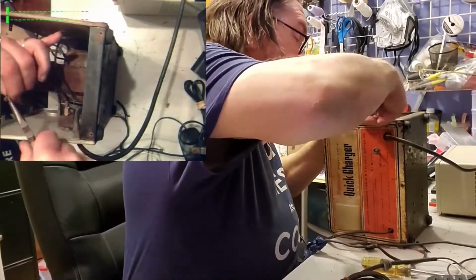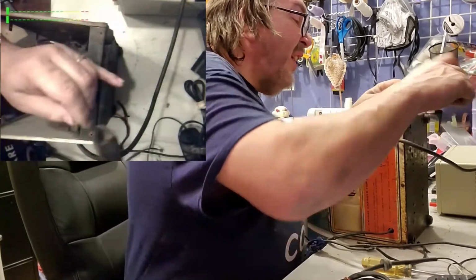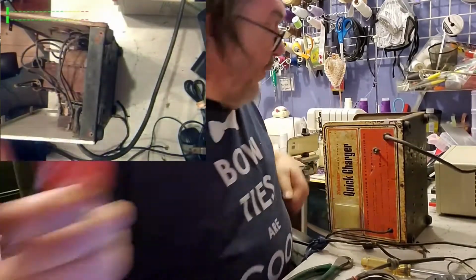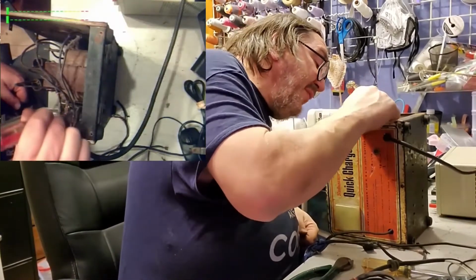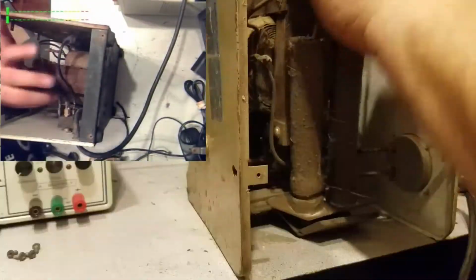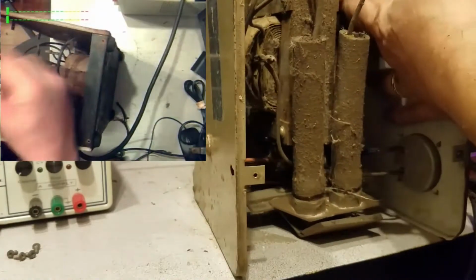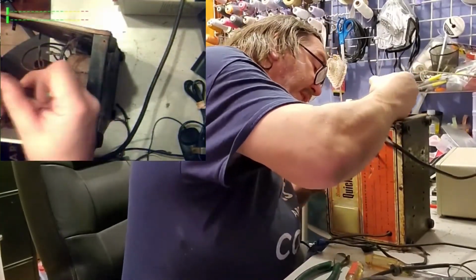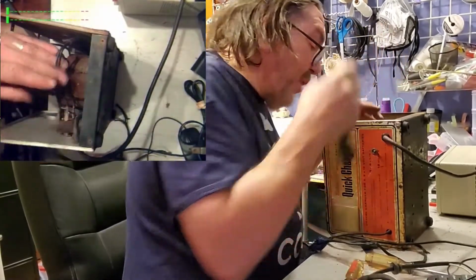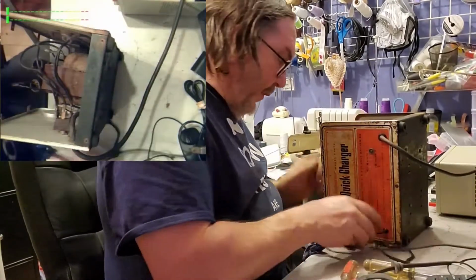So let's give this a little help. You squeeze the back of this a little bit, it'll still go on. Okay, but it'll be bindy when it gets to the back end, and that's what you want. Take a little screwdriver, make sure we scratch this. Turn a little bit. These other ones here, okay. I'll just reseat them to make sure they're all happy. See, I'm just kind of partially pulling them off, putting them back on. That kind of renews the contact area. Probably should replace that terminal, but I think we're okay. All right. So far, so good there.